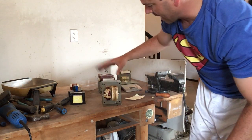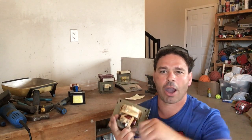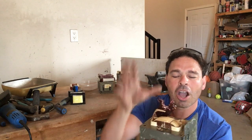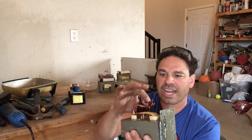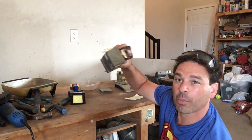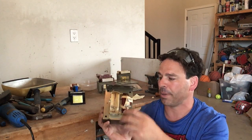For the last transformer, a shout out to viewers who suggested using an angle grinder to cut through the copper and then pop it out with a punch. I appreciate the comments and feedback — I love sharing knowledge with the scrapping community. I did try it with this one. However, because of the size of this transformer and my angle grinder, it was actually very difficult to get the windings out. It would probably work for a smaller transformer, but given the size and my tools, it is going to be very difficult to extract this copper just by using a punch.